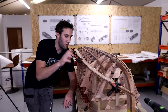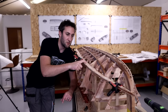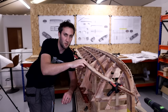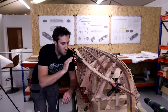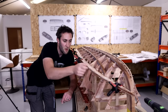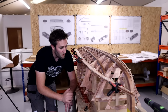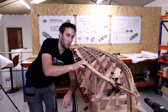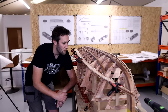There is one thing that I've realised with doing this that I would definitely do differently going forward or on the full size boat. If you remember, we actually laminated this chine flat quite some time ago when we set up all the frames and did all the laminations — when we were doing the stringers. What I would actually do is laminate this chine flat at this stage, after this top rail is in. It just gives you that opportunity to fair everything out nicely and get a good flat surface. Being able to clamp down to this top rail is really going to help to get this lamination good and flat. That all worked out okay with the way I've done it, but if I was doing this again I'd definitely do things that way around. It makes sense to have that top rail to give really good support to the chine flat.